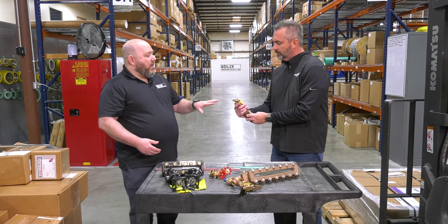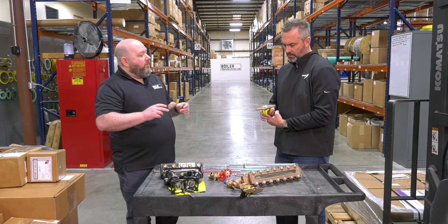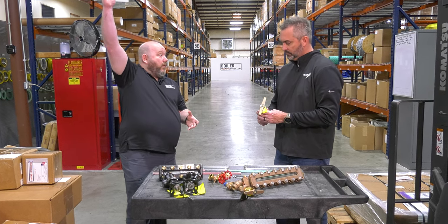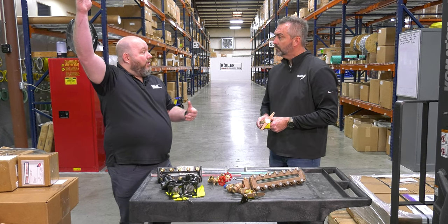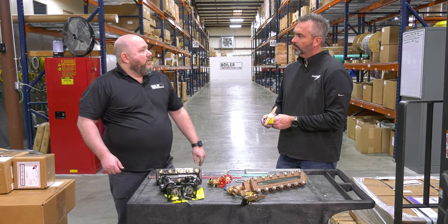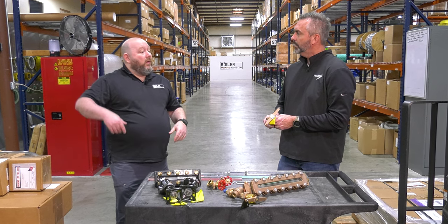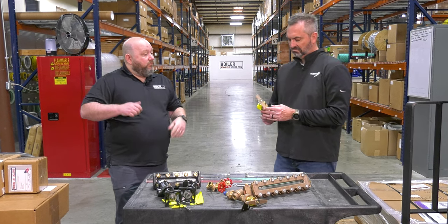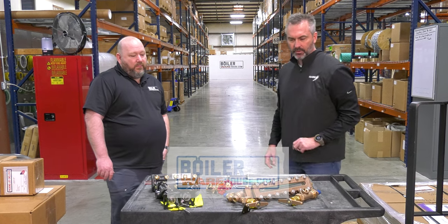With these sets you also have different valve types. This type of valve right here is what they call a quarter-turn quick-close lever-operated valve. Sometimes these water columns are way up in the air but you still need to operate your gauge glass, blow it down, and do all of those things. On these handles they'll have hooks with chains, so you can get whatever length of chain you need — we sell the chain, you just tell us how long — and then you can operate it from the floor without having to get a ladder out.